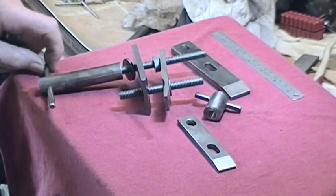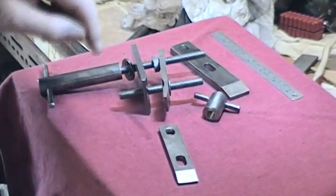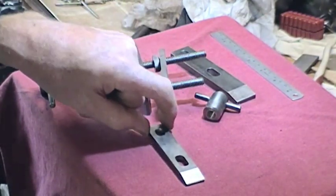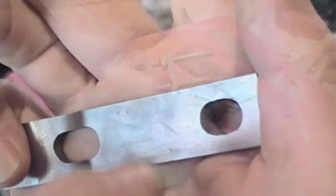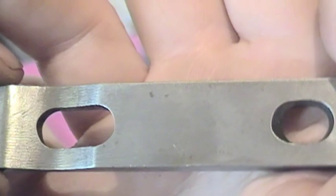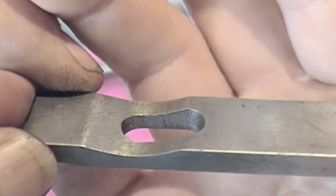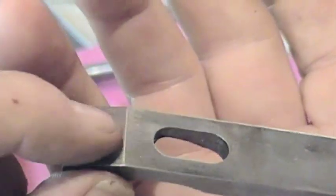I nearly forgot — just a short extra to tack on the end. I did make a pair of smaller jaws, and I think I may have made these before the large ones. These won't take quite as much pressure of course, but there were occasions when they were adequate. The rear slot is also chamfered here for the rear stud — that's to allow tipping. The front slot of course is clearance for when it drops. The scallop relief on this one — I forget why I did that, there's probably a very good reason — and the top is again finished with an angle.